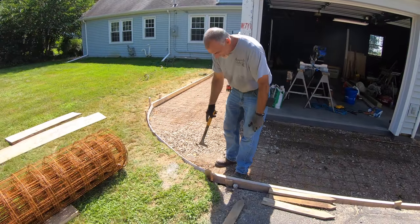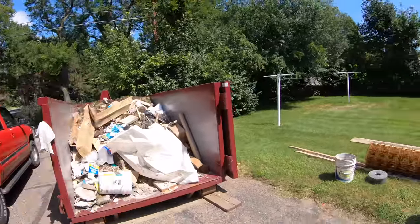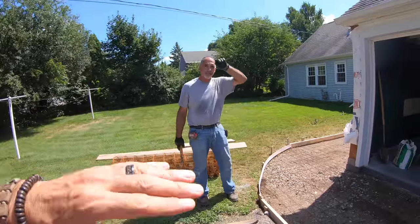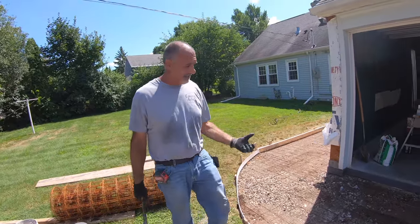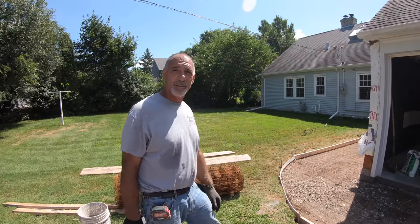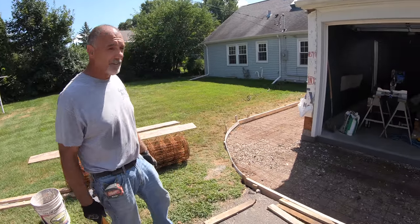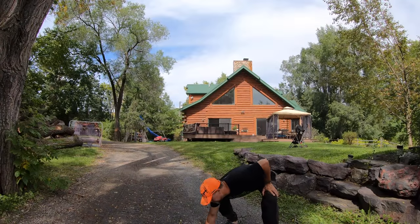Older, anyway. All right, so you've got everything excavated out. The soil, you're going to be hauling away. No organic material goes beneath any concrete ever, right? I mean, that's my rule of thumb. It's what's underneath it beside what you put over it. But we get rid of all the vegetation and the grass. Yep. Topsoil, basically. Yep.